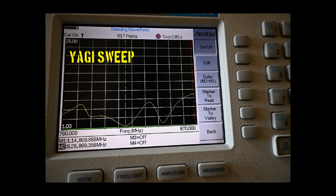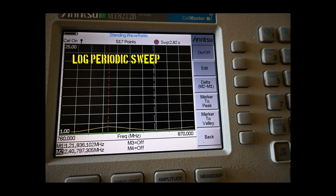We have to consider that we are covering 110 MHz of swept range, due to the plus 45 MHz repeater offset at 800 and the minus 30 MHz offset at 700. We then sweep our log periodic — and no surprise, it is performing as we would expect of an antenna of this design, matching and radiating over a wide range of frequencies.